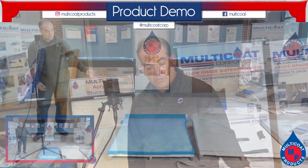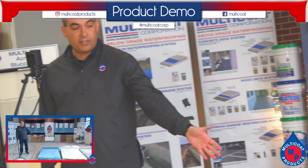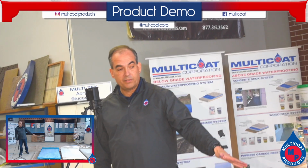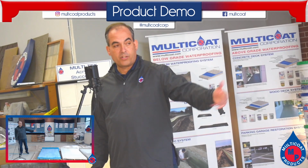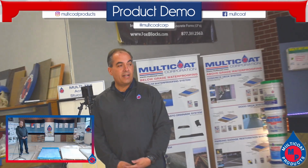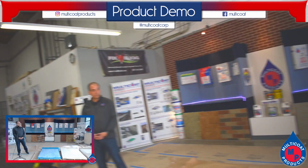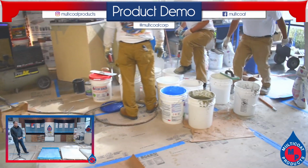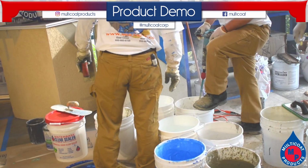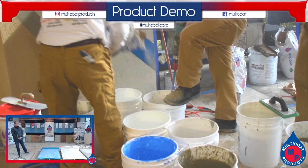So these boards that they're just bringing out right now, this first one has our Multicoat with the sand already all cured and dried. The next one will show a base coat of our creek coat. And the last one shows a texture coat of our creek coat. So Alfonso's going to put a base coat of creek coat over the Multicoat here. And again, the creek coat, like I was telling you earlier, is a very flexible, high impact product. Easy to apply.